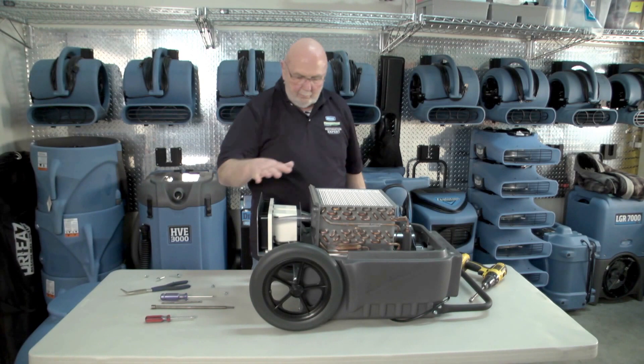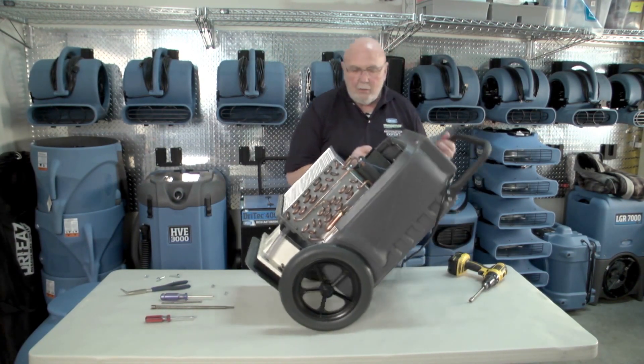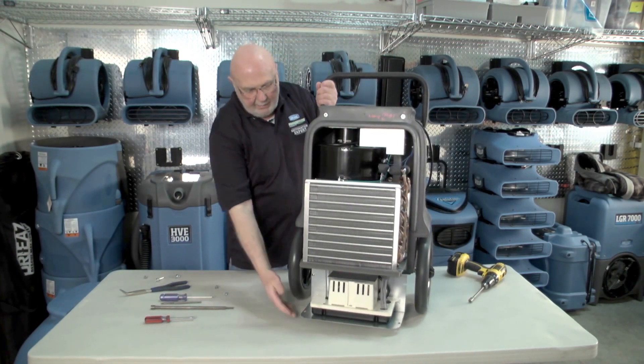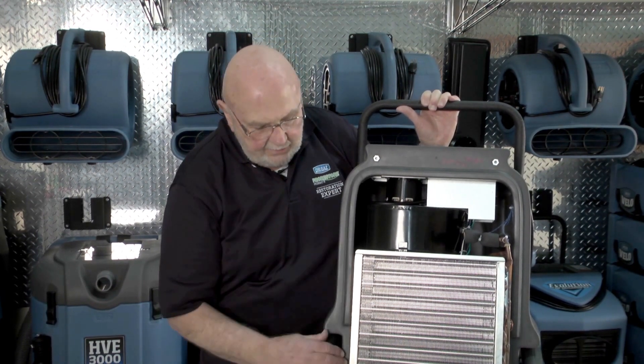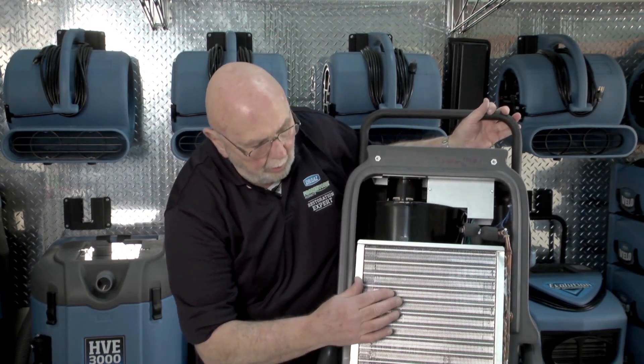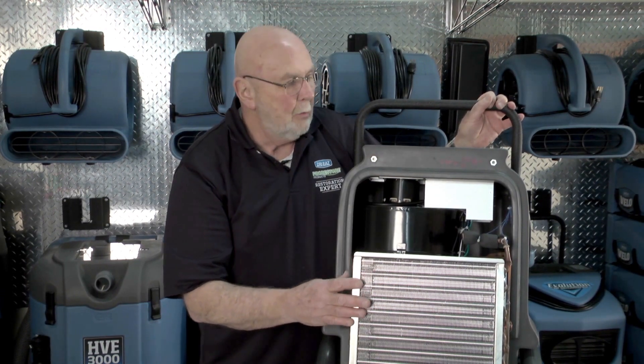I inspect the coil and I inspect the pump. If need be, I stand the unit up and put something underneath the foot of it that's about an inch thick if I'm going to run the unit. Everything that we do is about air flow, so pay attention to gaskets and to the fin pattern on this coil. When you clean that off or vacuum it off, you don't want to alter the fin pattern, so you've got to be gentle with it. Anything that affects air flow will affect how the equipment operates.